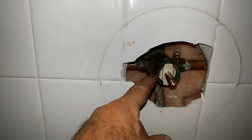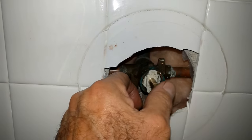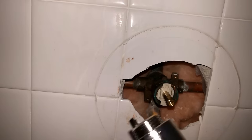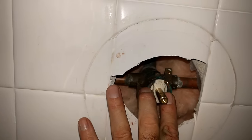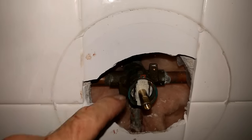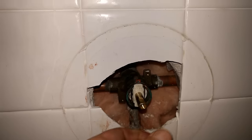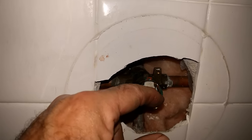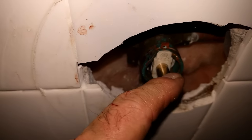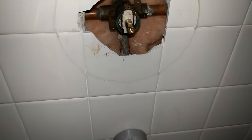Grease everything up good — put your finger inside there with some grease, then grease all the black parts. Put it in straight; don't twist it when you put it in — maybe one or two degrees. I use the extraction tool to push it in because it gives a nice place to push without having to push on the tabs. Now put the clip in. Put the HC up — the smooth part according to Moen's directions — and this bottom side has a little step on it. That should give you hot and cold, but if it doesn't, just take it out and flip it 180 degrees.